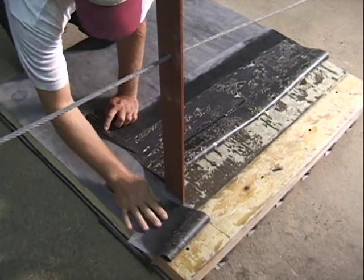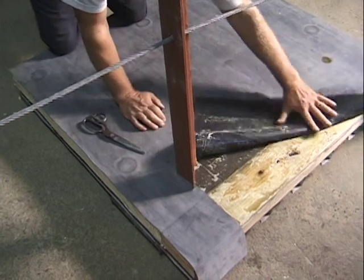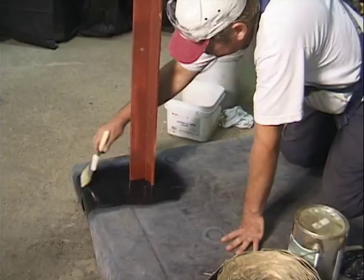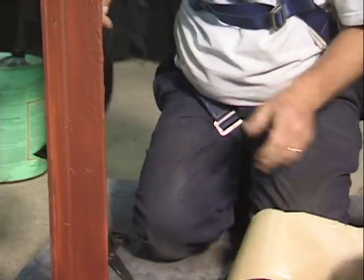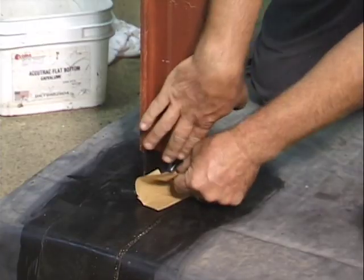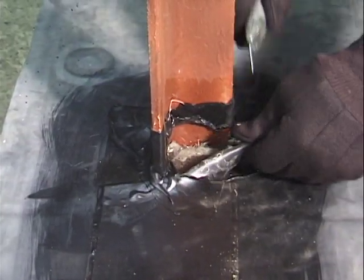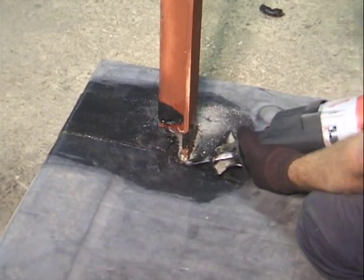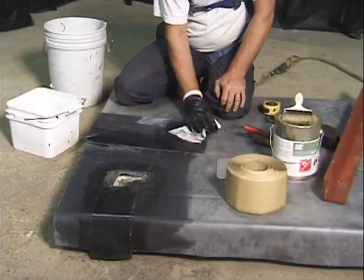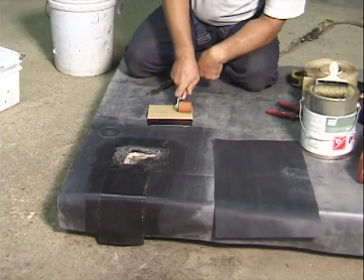In a conventional installation, the roof must be installed around the angle irons, resulting in a large slice in the membrane extending all the way to the edge of the building. This must then be temporarily patched so that it is watertight, allowing painting, carpeting, and drywall construction to continue below. When the job is done, the angle iron must be cut off and ground down. Then, a steel plate must be installed to protect the membrane against damage and the large affected area repaired.